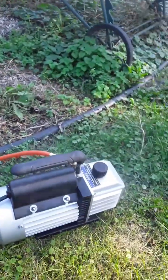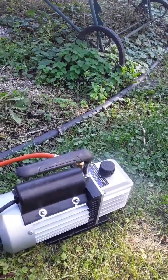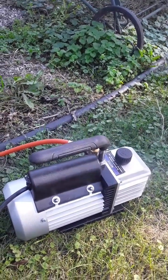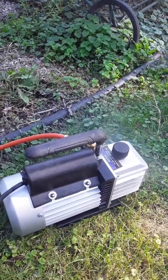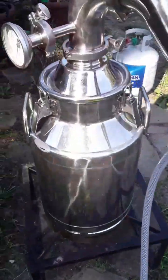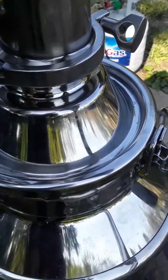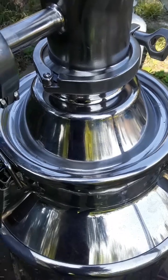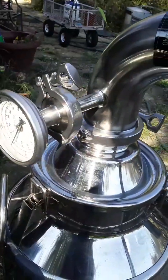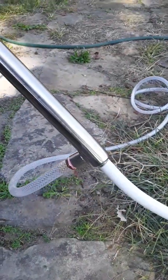Because we do have a small leak, the vacuum pump does start smoking a little — it's actually sucking air out constantly, which is something I have to deal with since I can't get a complete seal. I do know where the leak is happening: it's on the connection between the head of the still and the boiler itself — I can actually hear it as a really high-pitched squeal. Luckily, none of the other fittings have leaks.